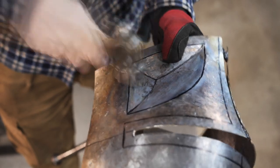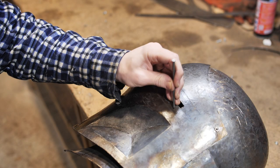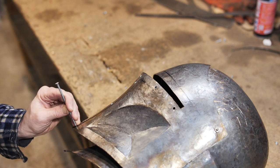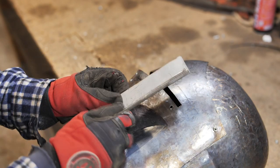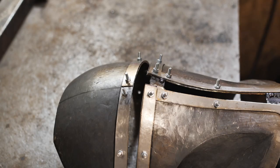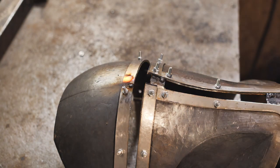The triangular cavity consists of outside and inside ribs. I shape the ribs on a special device and at the same time planish the area between them. The edges of the gaps on the visor will be reinforced by the cover plate. The increase in thickness will make them stiffer and also make them look better. To do that, I make 4mm diameter holes and prepare the stainless strip 1mm thick and 13mm wide. With the help of screws, I mount the cover plate onto the visor. I'm welding the areas of contact with the stainless wire with further polishing of the seam. This way the simple strips will be connected into one whole shape that would be hard to make in one piece.